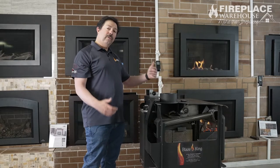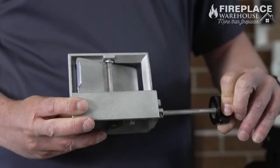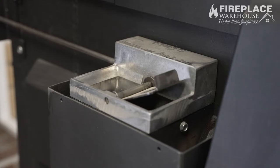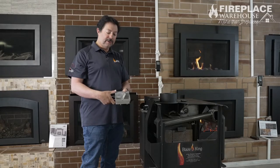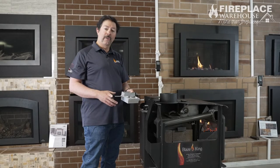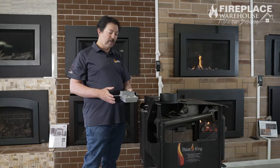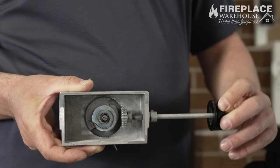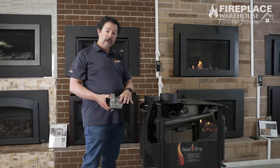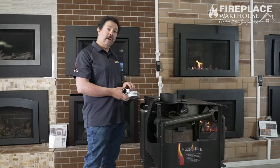You're going to let the stove burn for about 30 minutes with the air damper control open so everything gets heated up. Then, once the stove and everything is heated, you're going to turn it down and regulate it — because you are the thermostat — to the heat level you want for your home. This stove has a bi-metallic spring inside that will open and close on its own to maintain the same temperature throughout your burn cycle.